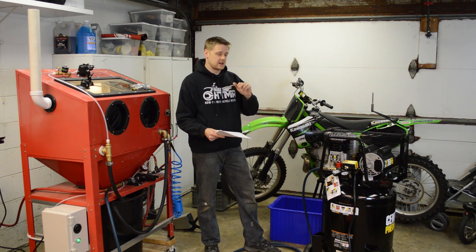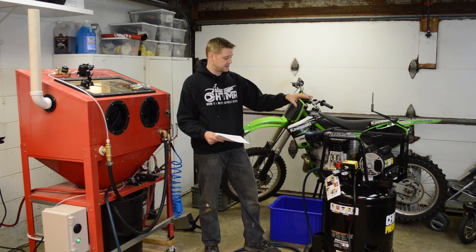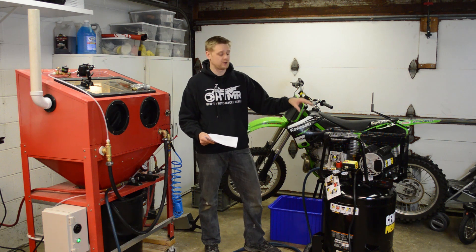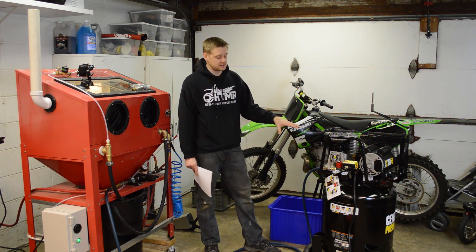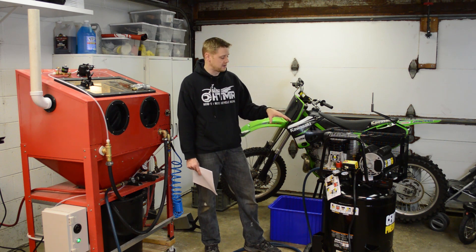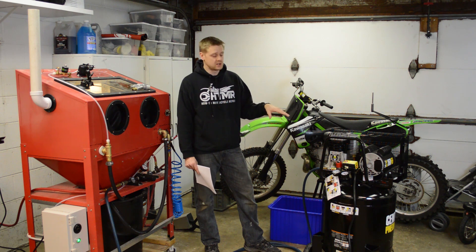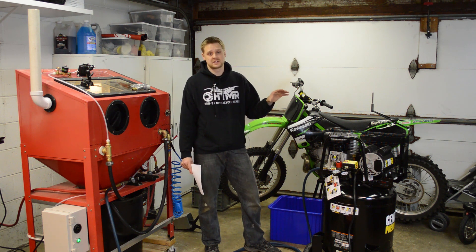You're not going to get this much CFM with a direct-drive oil-less compressor. They are noisy, they generate heat, and the duty cycle on them is poor — the CFM output is just not there. So you're definitely going to have to go with a two-horsepower belt-driven version like this. It doesn't necessarily have to be Harbor Freight; all the other compressor manufacturers make a belt-driven two-horse unit like this, and the output is around 6 CFM.